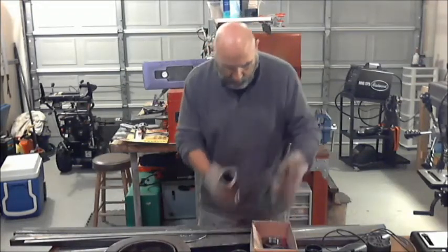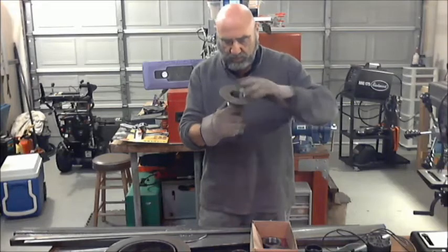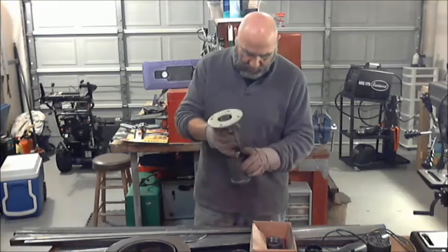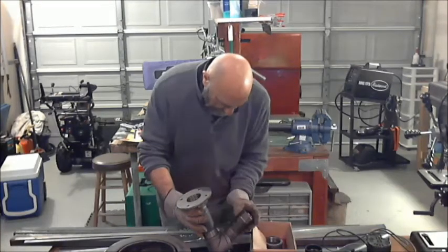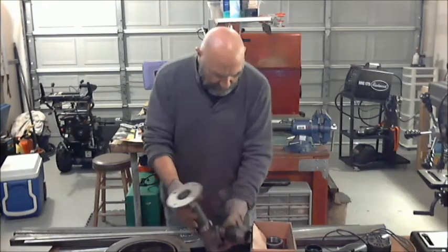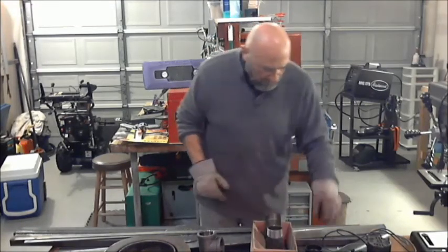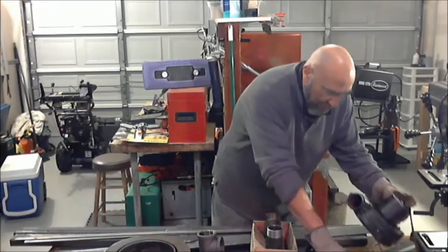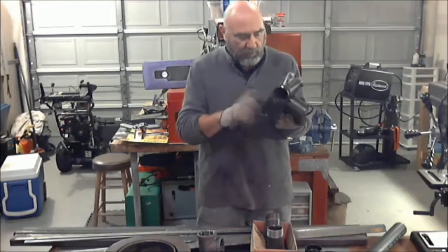So that's our fire pit. Of course we'll have our pipe nipples coming down underneath, and we'll have our air supply set up with a coupling that will ultimately connect to the plastic pipe far enough away. I'm using a fan from a power-vented water heater as my air source — these make great forge fans.